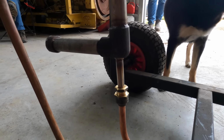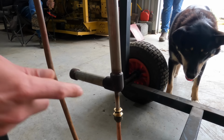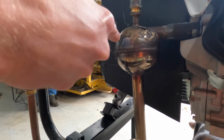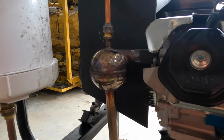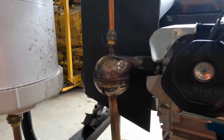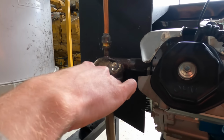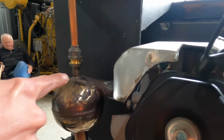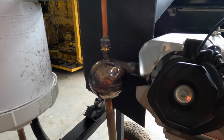and then we've got an inner pipe inside it. And so the cold stream of the plasma coming through from the generator is just coming up through that center pipe there, right up through the center of this sphere. And then this sphere, that's two spheres. We've got another one inside it. I'll ask the guys the diameter of these spheres in a moment, but the cold air is coming up inside it. The hot air is coming out of the exhaust here. This is where the retrofit goes. And then it's going in this outside sphere using the inner one as a swirl guide and counterclockwise spiraling down.